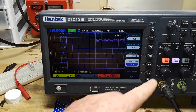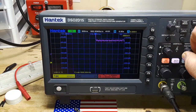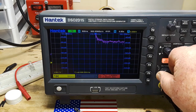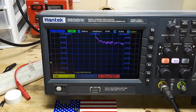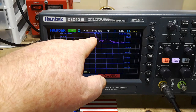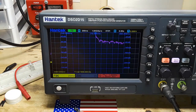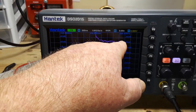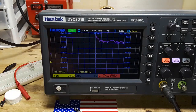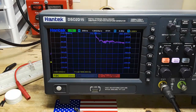Show only, yes, please. Good. So now, as you see, we're looking at that sine wave in the frequency domain. So right here is 312.5 kilohertz. And as we move across, we change frequency to up here where we're down to 250.31. We're here, we're at minus. Why the hell are we minus now? But anyway. So that's the fast Fourier transform.